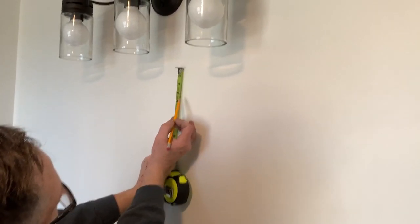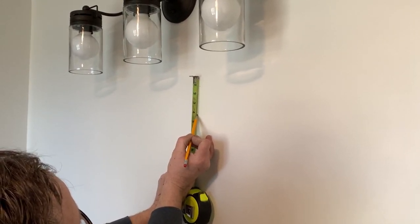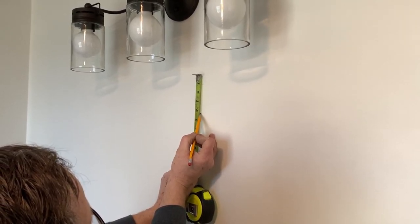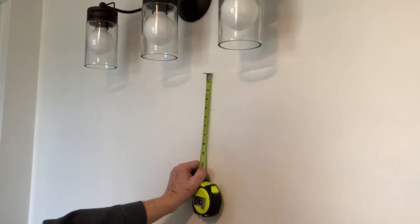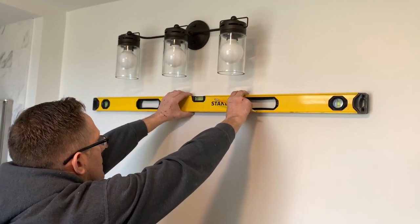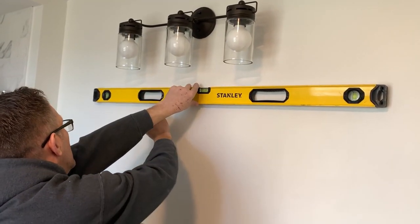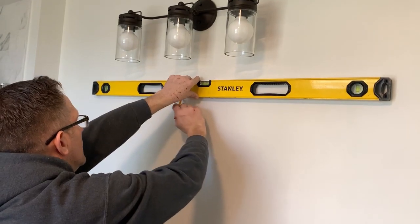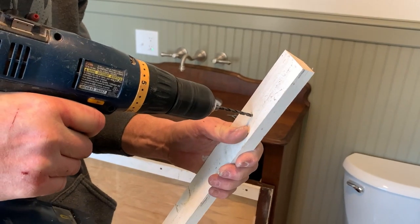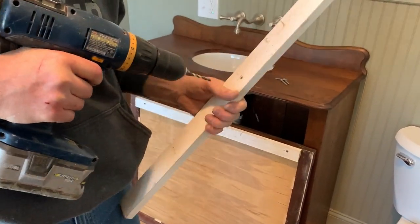Measure and mark for the second piece to attach to the wall. We determined where we wanted the top of the mirror to be — the top of the cleat is even with the top of the mirror. Measure down the width of the two cleats together to get the location of the line where the bottom cleat will attach to the wall. Make a level line; this line will be at the bottom of the cleat on the wall. After you draw the line, determine where the studs are and note those measurements. The cleat will need to be screwed into the studs. Pre-drill the second cleat, making sure to drill the holes so they line up where the studs are in the wall.